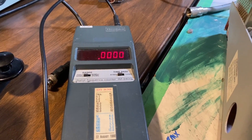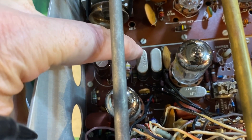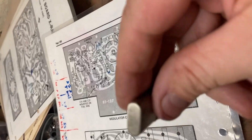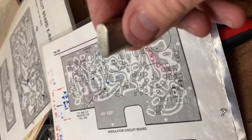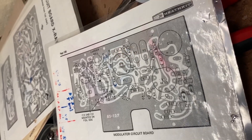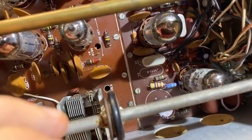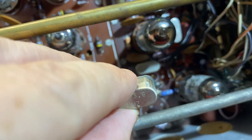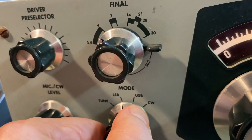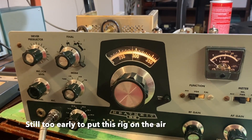So I'm going to replace the crystal. This is the Y2 crystal — I know that from checking the manual, and it's really easy to pull out. I just happen to have one of these from one of my cadaver rigs. These x-ray views in the manual are just fabulous. Literally 30 seconds to desolder that crystal and pull it out, and I'm going to pop the new one right in.